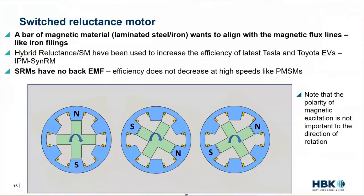Let's say we have the same kind of stator, but instead of embedding conductors in slots, we wrap them around poles on the stator so that we create magnets. In this case we're energizing this end and that end to produce a north-south magnetic field. If the rotor is made out of ferromagnetic material, it will naturally line up along the lines of magnetic flux — the path of least reluctance. That's how these motors work: you turn them on, the bars line up, then you turn on another set of magnetic poles and the bars line up with those, and so on to make the rotor go around.